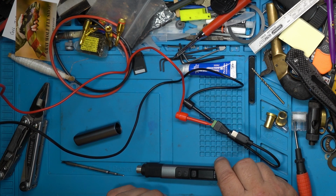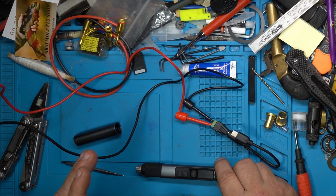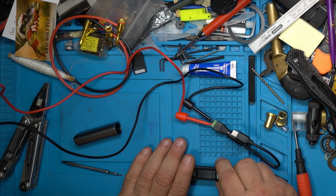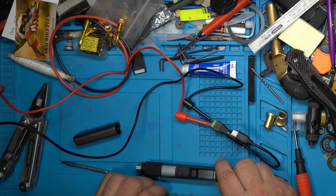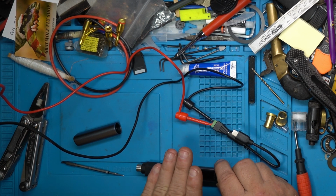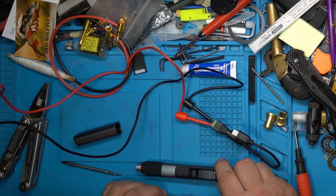If you get another power supply and hook it up, you then run adaptive power again, which will adjust to that particular power supply. And so adaptive power is not designed to be used every time you start your iron to get it to start at 100%. Adaptive power is used to adapt your iron to the power supply, hence adaptive power.